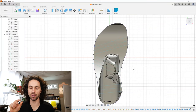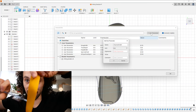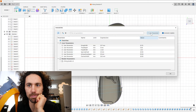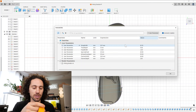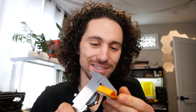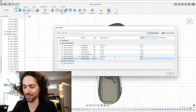We are ready for what I think is the final detail: the strap channels. The challenge is we need to thread this strap through a 3D printed channel that we can't access. If we make the channel 26 millimeters wide, it can fit in there no problem — maybe I'll do 26.5 just to be safe. The channel depth is the more critical dimension. This strap is only about a millimeter thick, but I'm not going to make the channel a millimeter thick — that would be insane. I'm probably going to double the strap to pull it through with a coat hanger, so we need it thick enough to fit doubled, which is only about two millimeters. There are so many small decisions you have to make with a design like this and every one feels critical. Let's go 2.7 just to be extra safe.